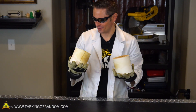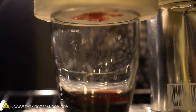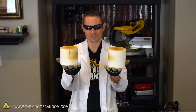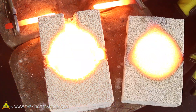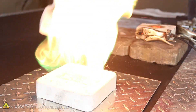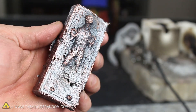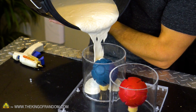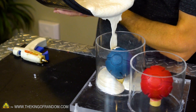These things are toasty warm, and they're completely hollow — all the wax melted and dripped out upside down. I let them cook overnight at about 325 degrees Fahrenheit, so most of the moisture is cooked out and they're nice and warm. I do have a little concern though — in a previous video I tried making a plaster mold of Han Solo and pouring in molten copper, and the heat vaporized materials in the plaster, leaving bubbles and pockmarks all over the casting. This is purely experimental, so you're seeing this for the first time as I do. If any of you are experienced metal workers and know a better way, please let me know.